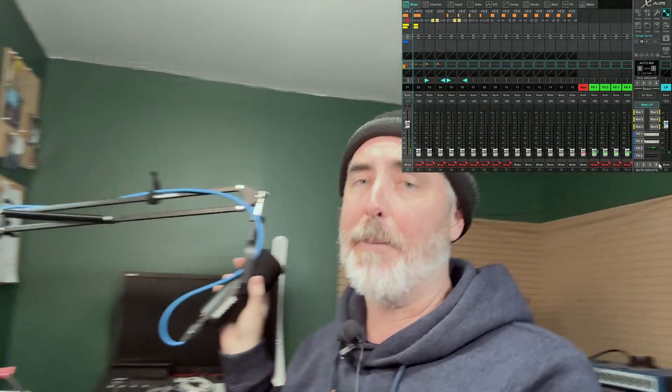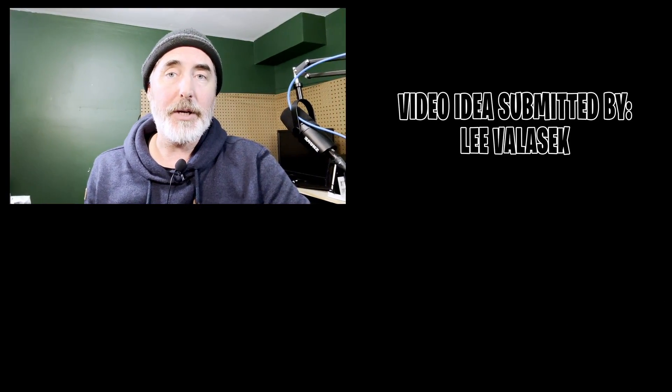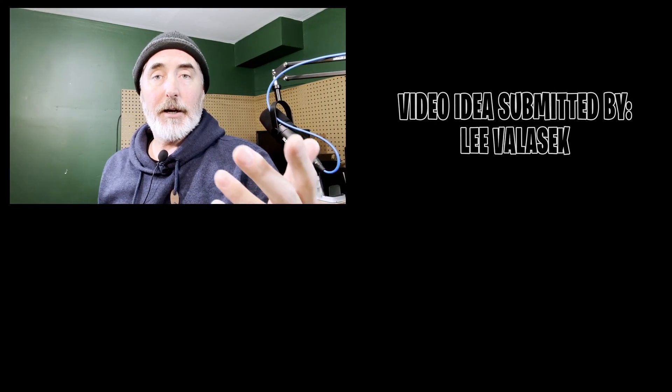You can see I've now got signal going and coming out of my main speakers. Am I hearing it out of both left and right? There's left. There's right. Yep, we have it in both. So that ribbon cable was the culprit. This has been happening to a lot of people — this video idea was actually submitted by a subscriber, and I'm glad they submitted it because a lot of people are actually experiencing this. If you've got a system that's not outputting or it's intermittent, please, before you send it off and spend money you might not need to spend, open this up and have a quick look at your ribbon cable. If it's not seated, seat it, and hopefully that brings you back to operational.